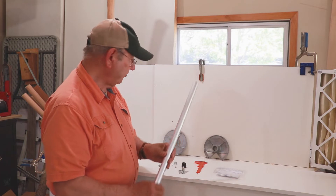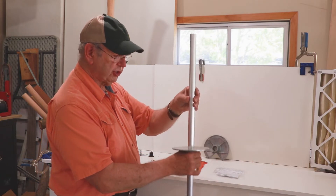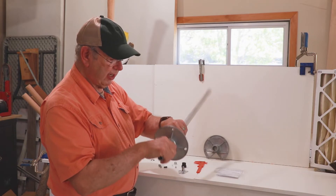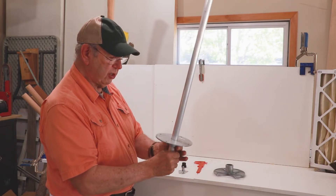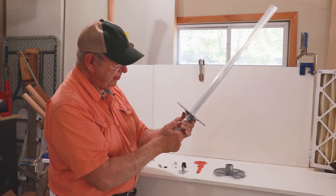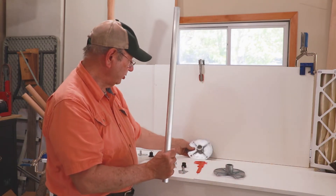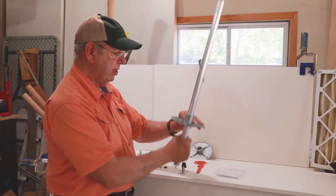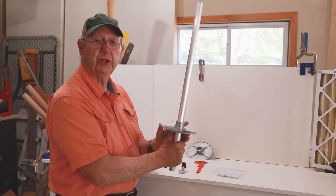The post fits inside of these plates. We have two styles. This one's called the WR14B — it sits on the pipe like this, and then you drop your shelf on top of that, so you would screw this to the bottom of your shelf. I don't particularly like this plate as much as the other one, and I'll tell you why. This plate goes to the bottom, your wood shelf sits here, and then your set screw for locking the shelf is under your wooden shelf. So if you're at the bottom, it's real hard to get at this set screw and tighten it up. Whereas if you use this plate called WSB2, you slide it on the pipe and your wood shelf goes on top. Your set screw comes through — let me show you how that works in practical application on a piece of wood.